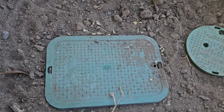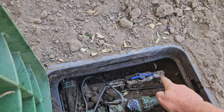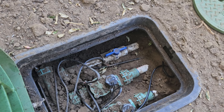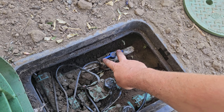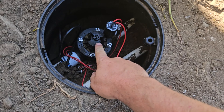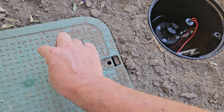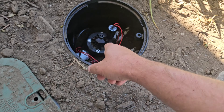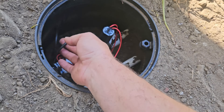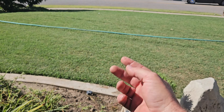All right, so this is what I put in last year. As we open this up, I've got this pipe right here that goes to my Irrigreen system. Now I can manually turn this on and off — I installed that myself thinking it was a really cool idea, so if I ever wanted to turn the Irrigreen system off for good manually I could do that. What I should have done is put a master valve in right from the get-go. I did decide to keep the manual shutoff, and on top of that I got this master valve set up so that when the Irrigreen control box tells the sprinkler to turn on, it also tells this valve to open — and the water flows through and the sprinkler head pops up and runs.